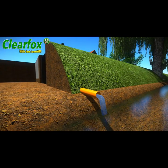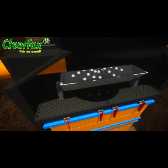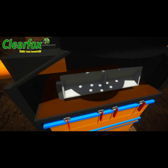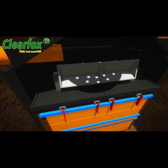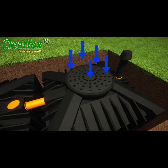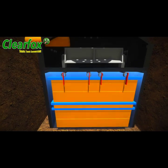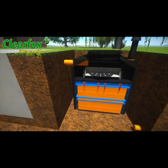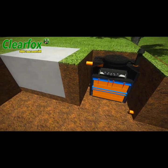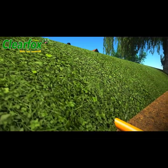This non-electric system allows septic tanks to legally discharge into water courses and ditches. Septic tanks fill up with sewage waste; this sewage then enters the ClearFox and fills up a trough. The trough tilts over, spilling the sewage through an organic sieve, which then enters an organic hive full of bacteria and enzymes. The ClearFox system is powered by venturi suction — oxygen-rich air feeds and fuels all the organic bacteria and enzymes, which then convert the sewage into safe, clean water. This government-certified system can then legally discharge this clean water into a water course such as a river, brook, stream, ditch, or culvert.